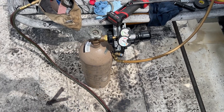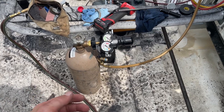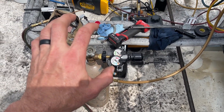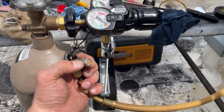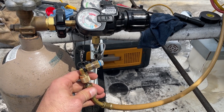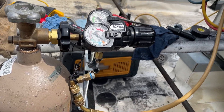I'm letting the pressure out now — this is not necessary at all, just a preference. The whistling that nitrogen makes is like nails on a chalkboard to me. This is a muffler for filling CO2 tanks and it allows you to just let the pressure out fast without that ear-piercing shrill.